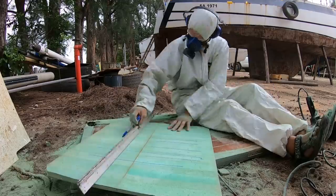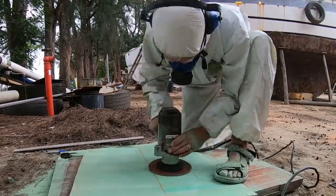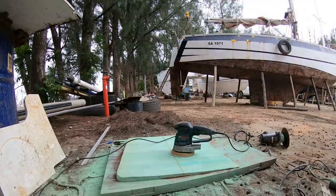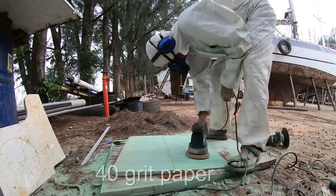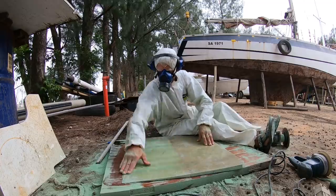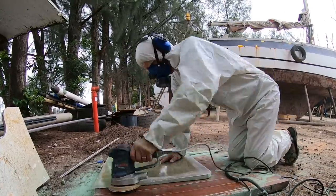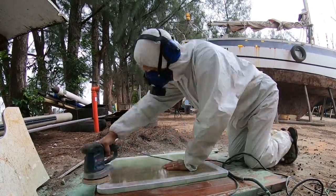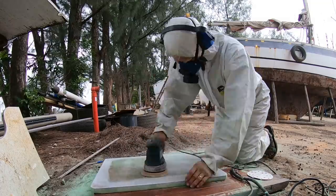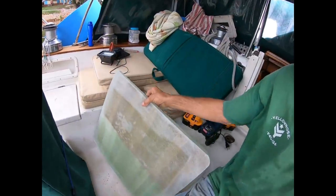Even 24 grit on a heavy sander hardly made a dent in this incredibly strong foam panel — a big surprise. An angle grinder with 16 grit paper was needed to attack it. A straight piece of aluminum was used to check for high spots, which were marked and attacked with 24 grit on the heavy disc sander. The random orbit sander then smoothed things out and created the bevel — a taper of a little more than an inch (about 24mm) at its thickest end down to a knife edge. Then all the smooth shiny glass surface had to be sanded off: 60 grit around the edges for tabbing and 80 grit in the field for painting.